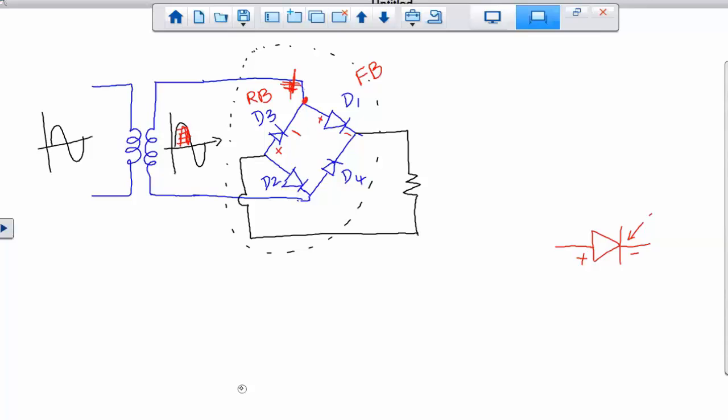So what, you're saying something? This positive right here on the top, it's the input signal positive right here. That's only when I'm talking about the positive cycle, I'm putting positive right here just to indicate that it is the positive cycle. That's all. It has nothing to do with the orientation of the diode. The orientation of the diode is still negative at the top for D3, positive at the bottom, because that's the cathode and anode. The circuit is not going to be flipped.